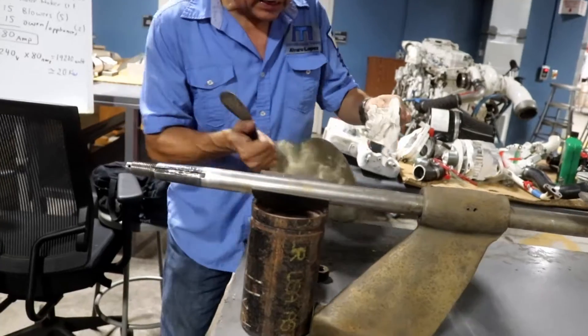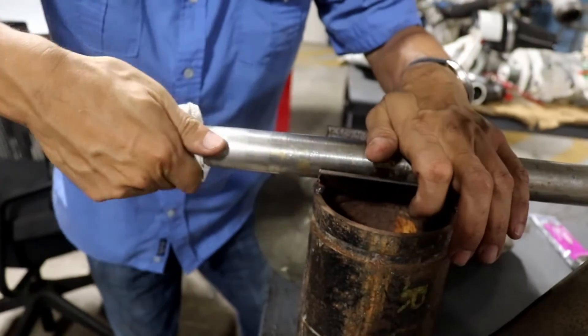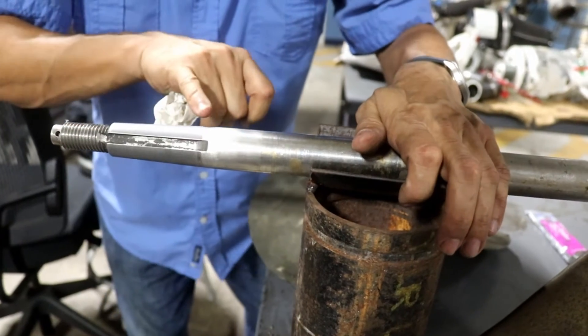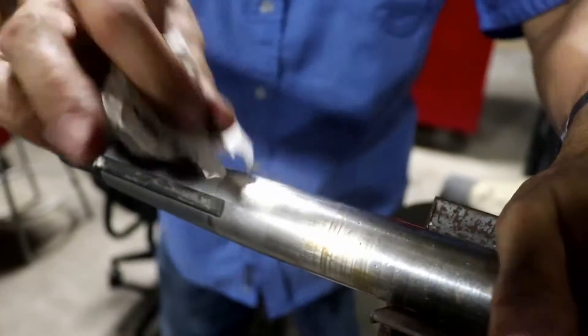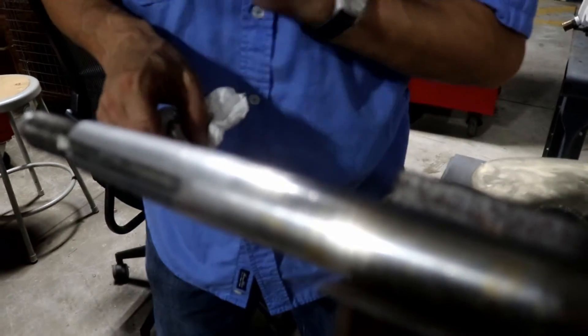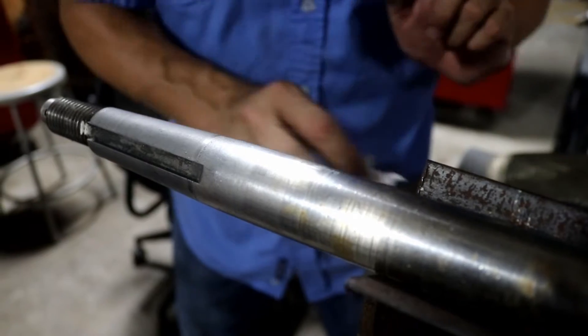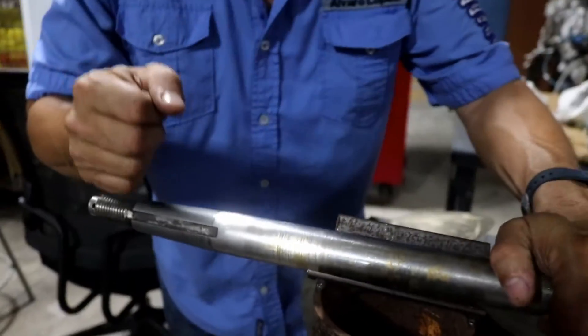After that, I recommend you remove the propeller and clean the surface. Verify that you don't have dents or cracks, and verify that the surface is completely polished with no clean areas. If you have clean areas, you need to apply new compound and lap the propeller again.